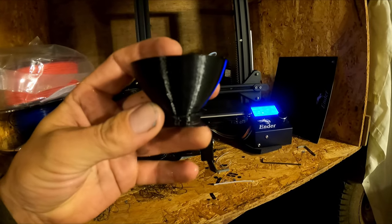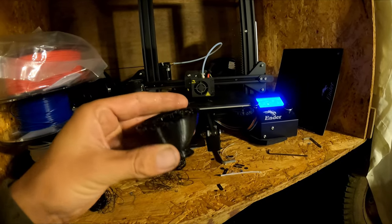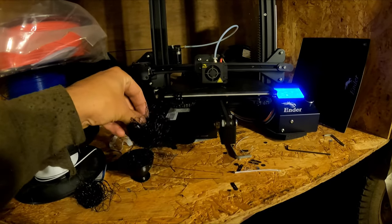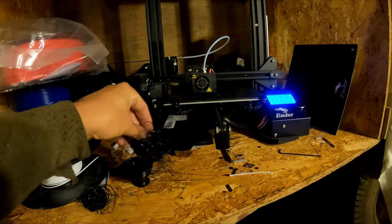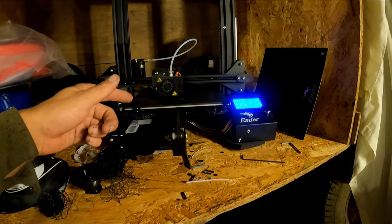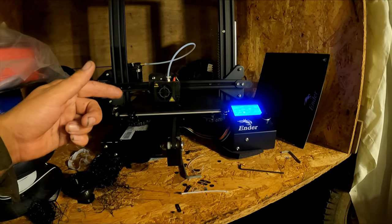The 3D printer's printing me out a cone. I tried to make a cone but printed it this way up so I could use less support material, but it slides on the bed a little bit and gets out of sync, so it just sort of messed up the side itself. I've heard you can use glue sticks on the bed because it's a glass bed — let me know in the comments what you guys do.